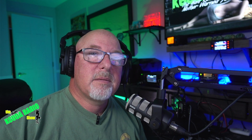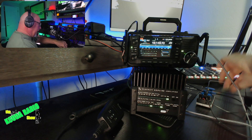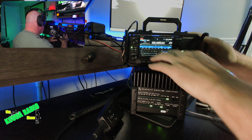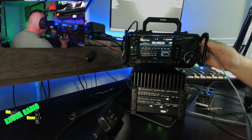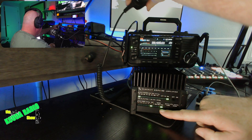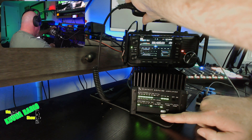Suppose you just don't have an external keyer for your radio — you're not a CW guy, you're new to this. Say you're a Technician and you intend to operate only on 10 meters between 28.300 and 28.500 MHz. I'm going to unplug the keyer, go up to 28 MHz, switch to FM, hit the tune button — back in auto — and key the mic.